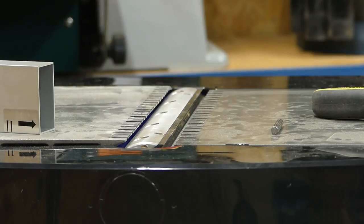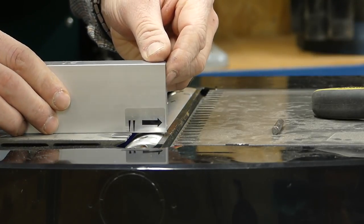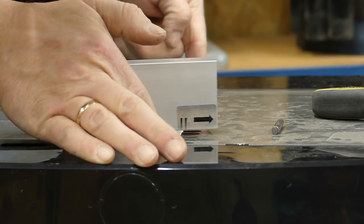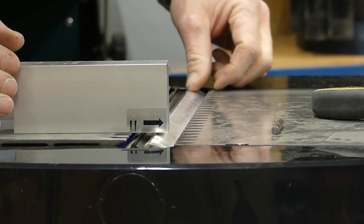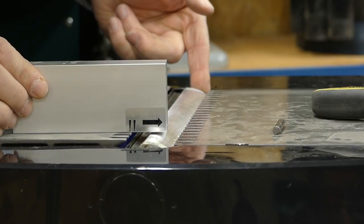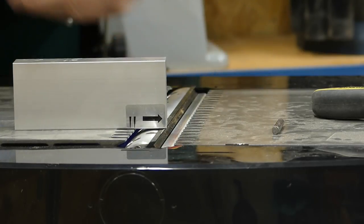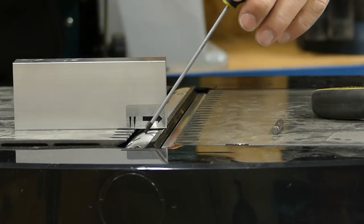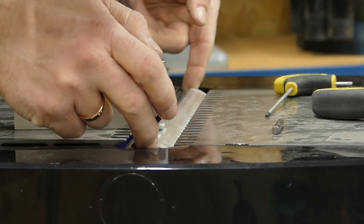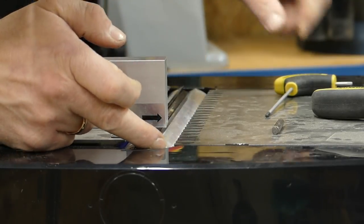And now the manual says the blade has to be so high that this gauge here is taken from this arrow to that arrow when you turn the drum. So what I have to do is turn this, put this here, and now when I turn, wait a second, once again. It has to be taken one step further, and it doesn't at the moment, so here's the set screw. Have to take this blade up a little. Once again. Not really high enough yet.